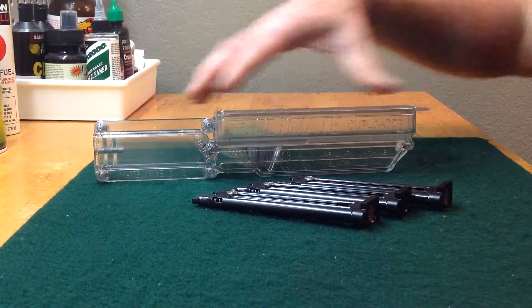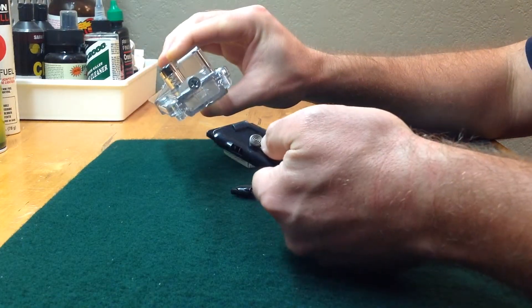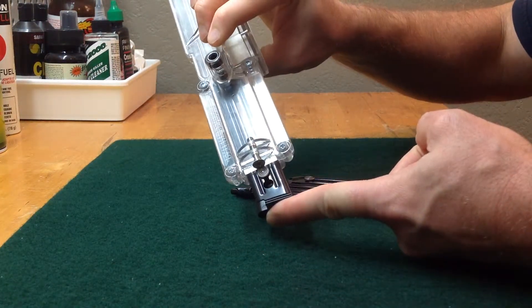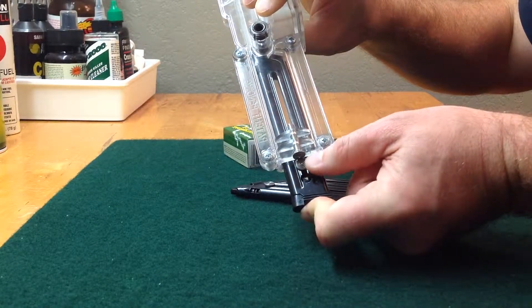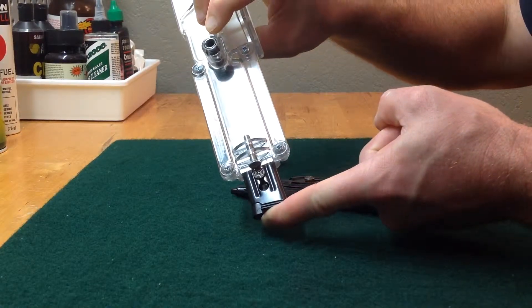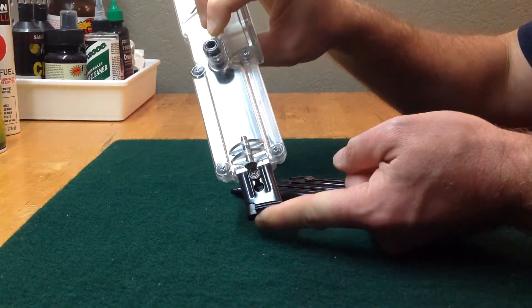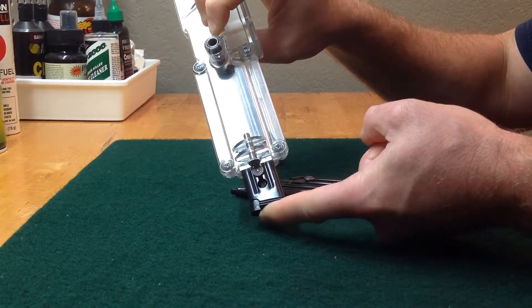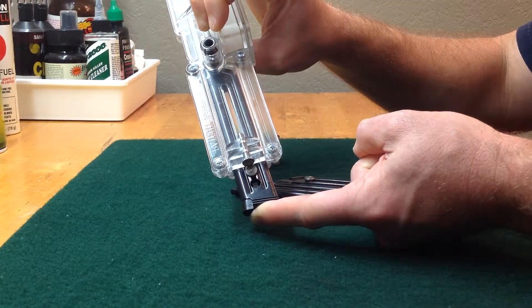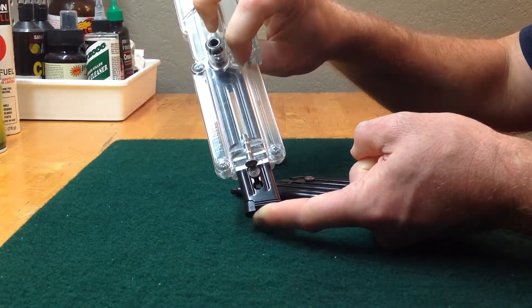Right off the bat, I did need to adjust it. You have a screw here that's going to push on the follower button on your magazine. When you push that in, it holds the button and allows the magazine to enter this little tube here, keeping the follower in place so rounds can fall into the magazine. You need to make sure that this distance allows for a full 10 rounds. If the screw is in too much, you're not going to get a full 10 rounds. You may need to play with that a little bit — it's not rocket science. If you're fitting 10 rounds, you're good to go, but you don't want room for an extra round to fall into the chamber and fall out.